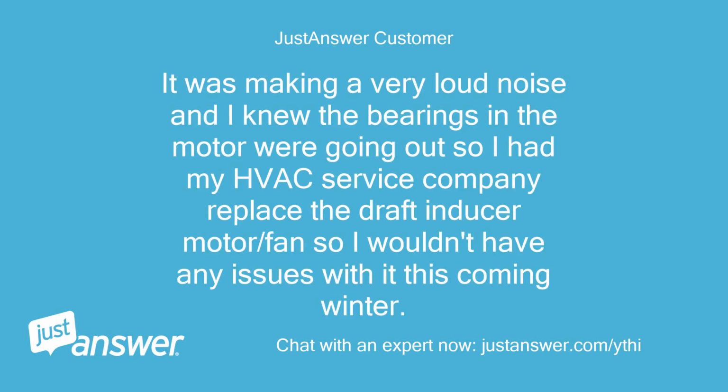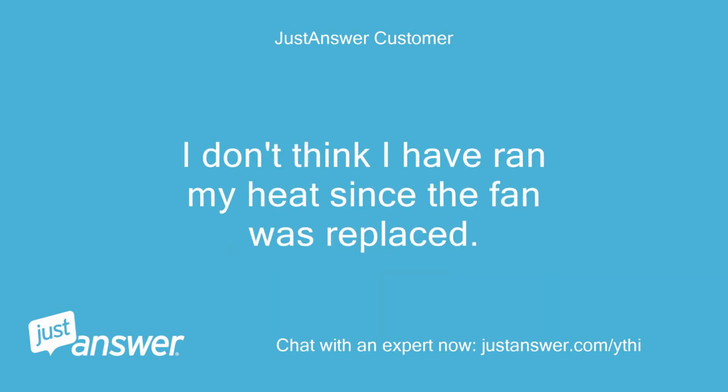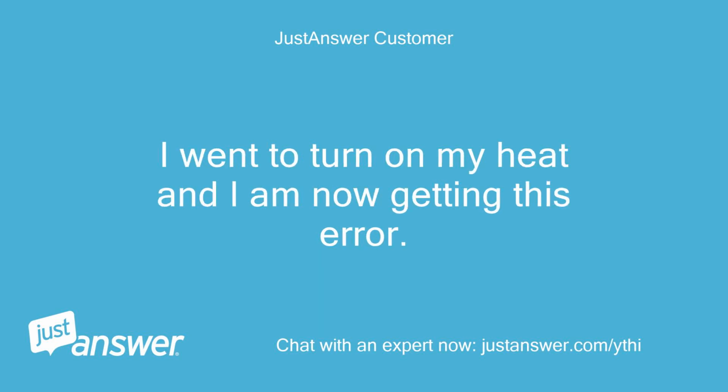It was making a very loud noise and I knew the bearings in the motor were going out, so I had my HVAC service company replace the draft inducer motor/fan so I wouldn't have any issues with it this coming winter. I don't think I have ran my heat since the fan was replaced. I went to turn on my heat and I am now getting this error.